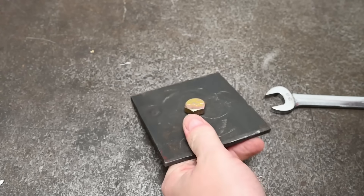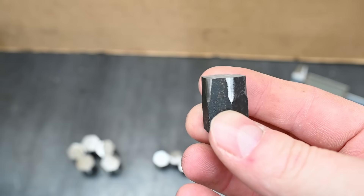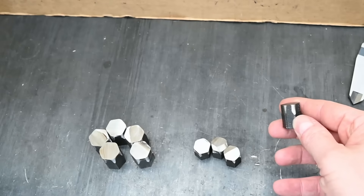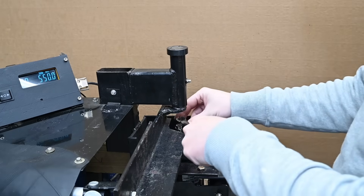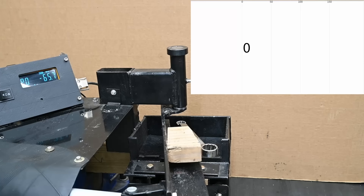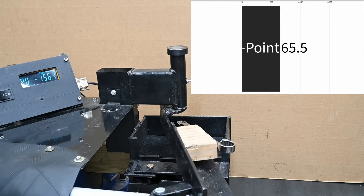With each hardware type we're also going to show its use on 40% rounded versions to see how things change. This was done on our rotary fixture and bench grinder. That amount of rounding sounds like a lot — which is why brands use it for marketing — but it really isn't that much. The math: take the 5/8" dimension and the dimension across the points, remove 40% of the difference. They're still hex-like. It's not the most mangled bolt head you'll encounter, but it is consistent for our testing purposes.